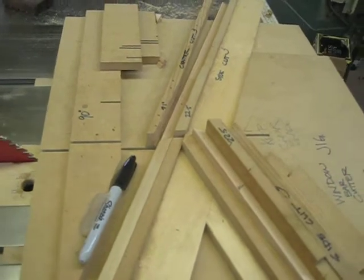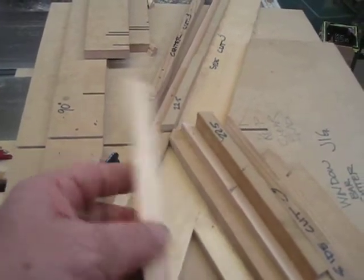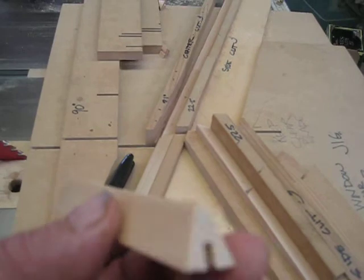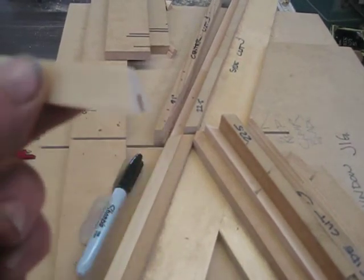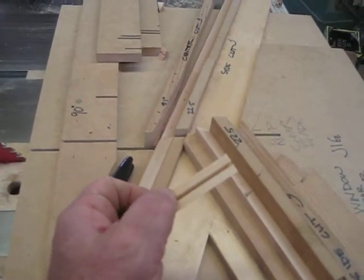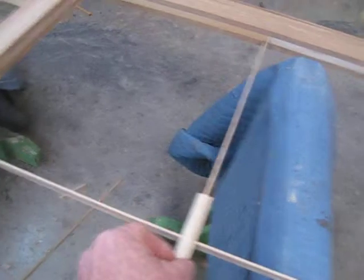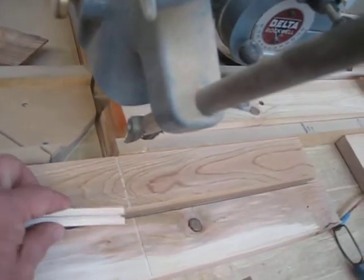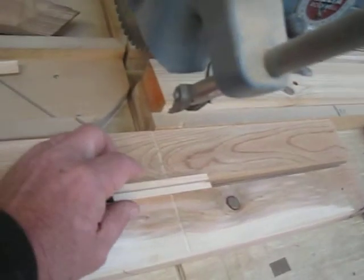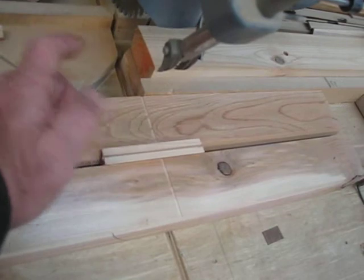We make a little jig that puts all the corresponding pieces in. It's got a 90, and left and right copes. Because this pattern is straight, it doesn't require a shaper to make the cope — what it does require is a little groove so that it can cross over and make these. That's simply accomplished at the radial arm saw with a little trough.